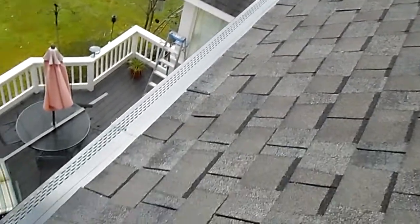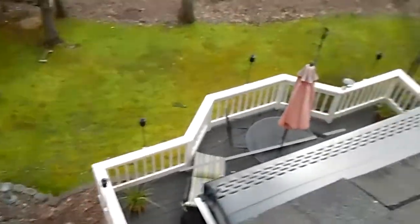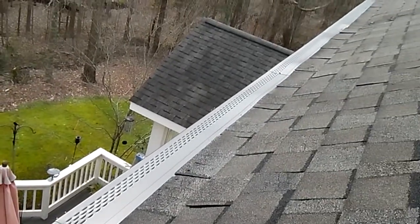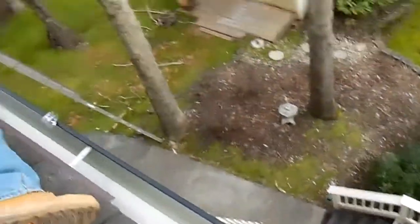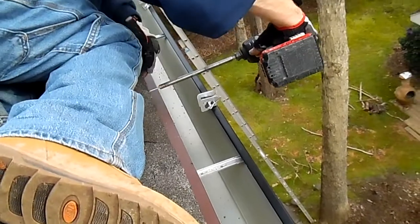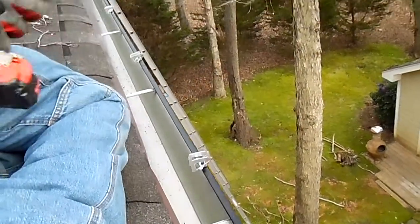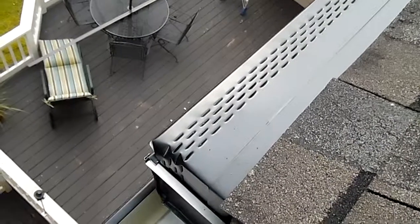Just want to give you an up-shot view of this nose-over gutter cover installation along with the new gutters. Short shingles were definitely an issue on this house, so the whole house had to get flashing — which is this aluminum section that Jeremy is actually putting in here under both courses of shingles and running it into the gutter itself.